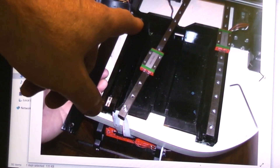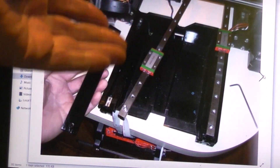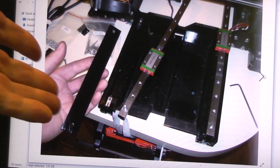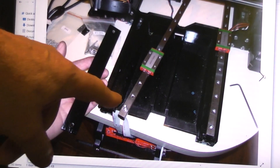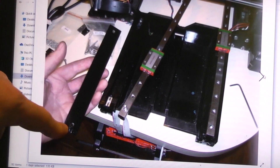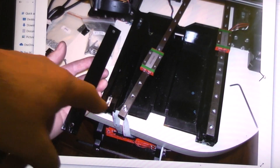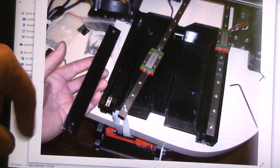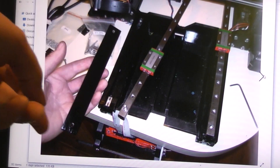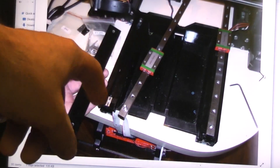So I had two options: I could file the edges down where the carriages were hitting as they passed back, or I could raise the whole thing up two to three millimeters to match the original height. I decided to raise it up. I could have used flat washers, but I didn't have any. I did have some scrap aluminum — about an eighth of an inch thick. The width just needed to be as wide as the rails or a little bit wider. I popped a couple of holes in it to match where I'd run my T-nuts, painted it black so everything would look better, and slapped those down and bolted the rails right in.